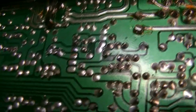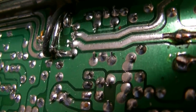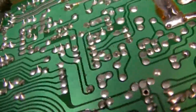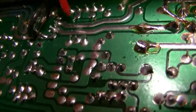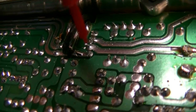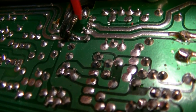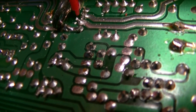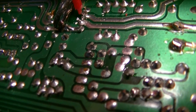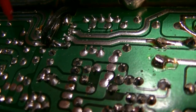Okay Don, I found the problem. See those two runs coming in there? These two runs right here - this one and this one. Look right in between them. See that? That's just a little spur, a little hair of solder right there. That's what's causing your problem. I think it is anyway. Getting ready to take my soldering iron and clean that out of there and we'll see what it does.